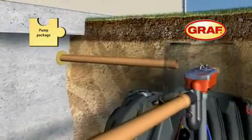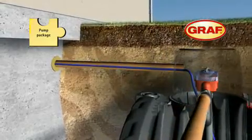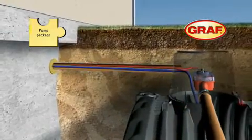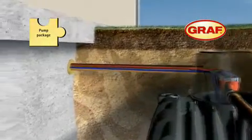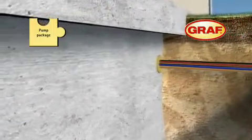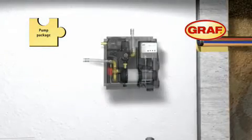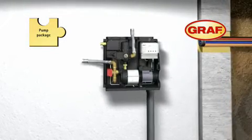This pipe is used as the conduit for the floating rainwater suction hose, the supply hose for the OptiClean unit and the water height measuring sensor cable. The convenient control of the Graf rainwater harvesting system is provided by the AquaCenter Silencio, which is installed, for example, in the utility room.